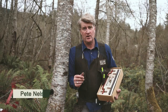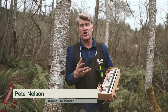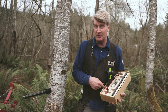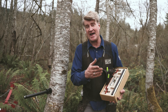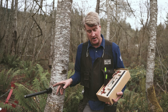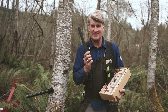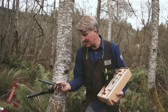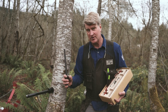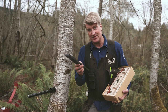Here's an important note. When you are designing your treehouse and getting ready to install the hardware, the plan is going to tell you what tree is going to have a dynamic uplift arrester versus the static uplift arrester. That is important because where you put a dynamic — like we are here — we have to account for a half inch of this high density plastic. So this is actually going to lift the beam up fully a half an inch. So in your plan, remember to lower the tab by half an inch.